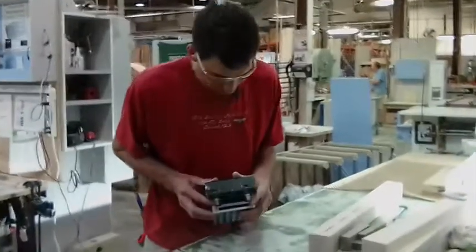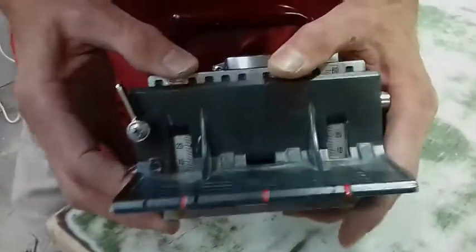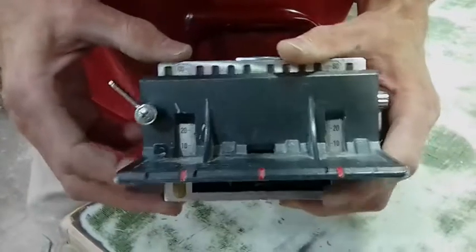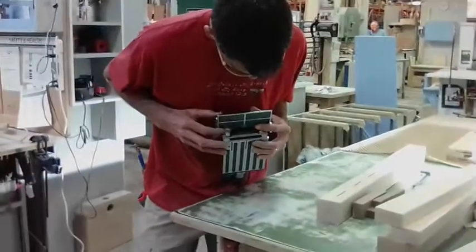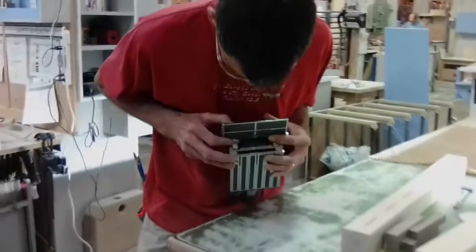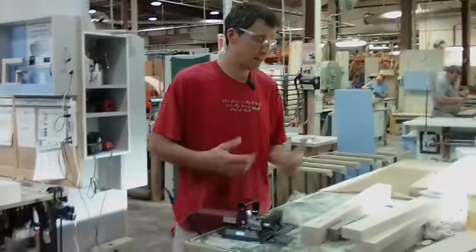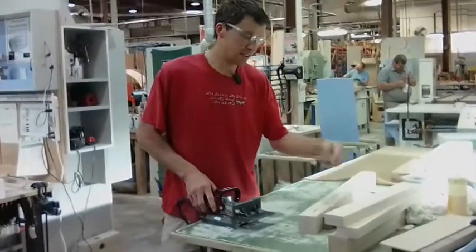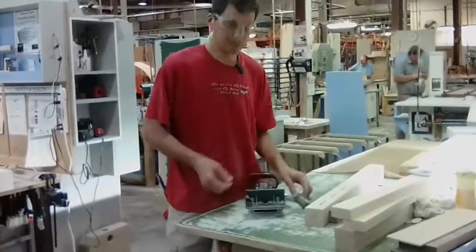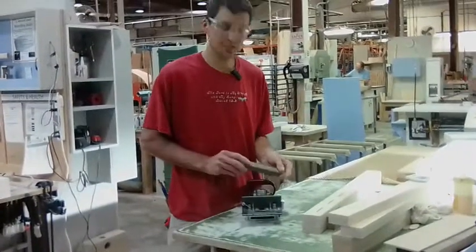If you look in here close, I don't know if you can see it, but there's a gauge on the left and right, and that's because this thing doesn't square itself up. So I've got to make my setting, let's say I'm going to 30, and get it to line up on both sides as I tighten it. Okay, so now I'm happy, I've got it at 30, and I can go ahead and use my biscuits. Then, after I do a few shots, I have to set it to 17 mil. So I would normally have to go through that same process again.